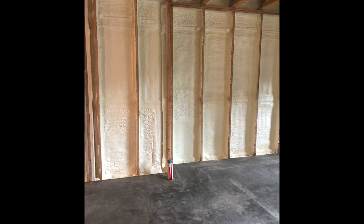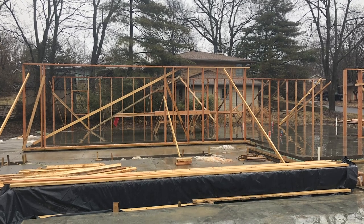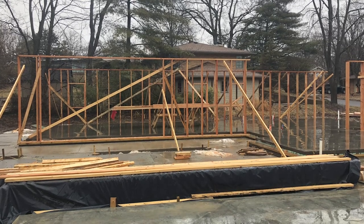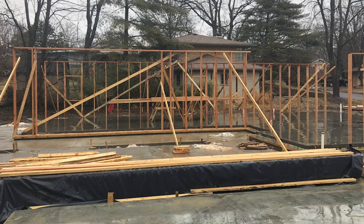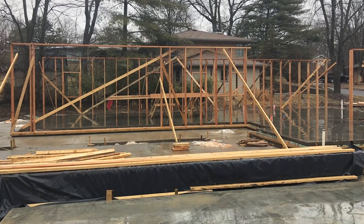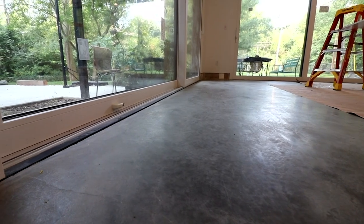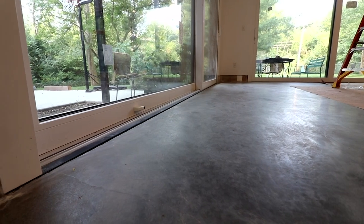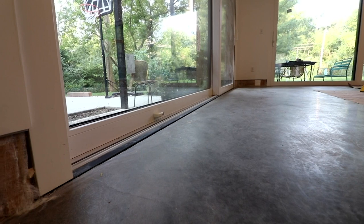One interesting thing: the house is designed with no load on this floor — it's non-supporting in every way; only the perimeter where the plate sits supports the structure. Because of that, we were able to delete all the steel in this slab. I know that sounds completely counterintuitive, but this slab is neither under tension nor compression — it's just sitting, completely captured, with nowhere to go.